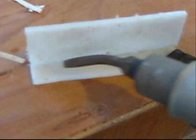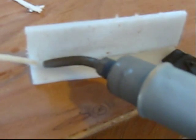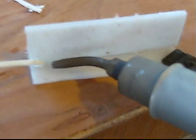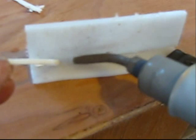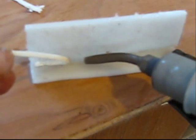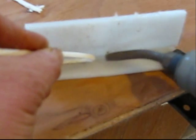Now install the welding tip. Since I am welding a heavier plastic, I will turn the temperature on my air welder to max. You will be melting three separate pieces of plastic — the two base pieces and the welding rod — so the air will need to be moved around to keep all three pieces gelling without overheating.